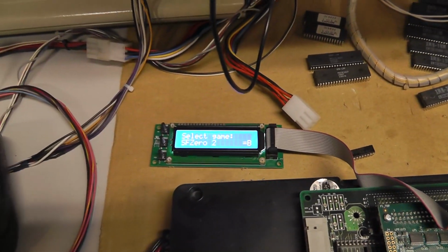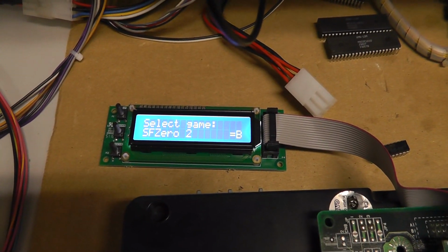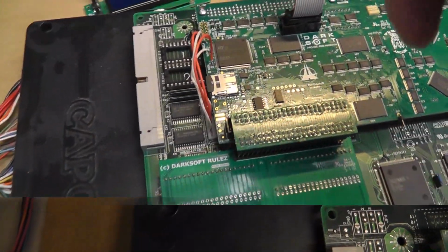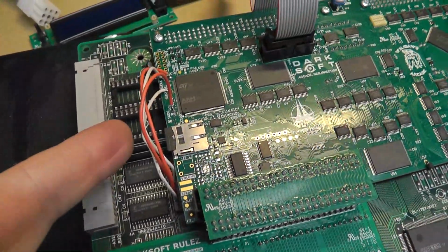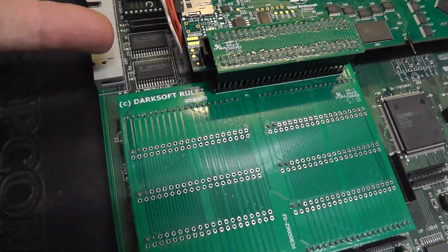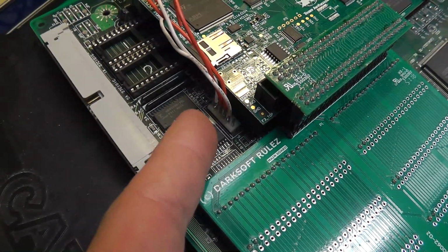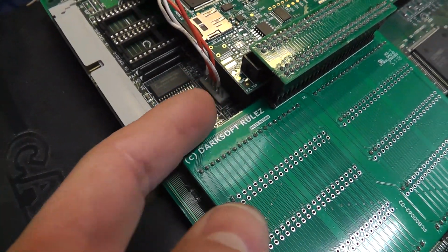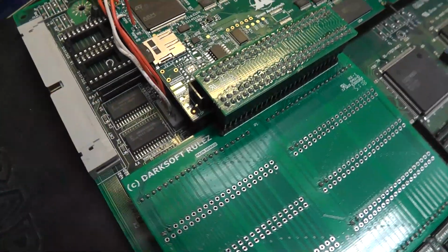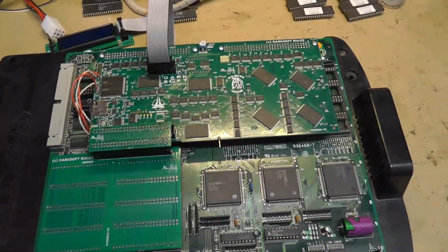Oh, you know what? I didn't check to see if there's an actual key in that folder. There should be, I think. I don't recommend doing it this way, but quick and dirty. I did the little jumpers, data, clock, and hopefully the pins are going to the left there. 1, 2, 3, 4, 5, and 6. I see a number 6 over here, so I'm hoping that is correct. Plug me back in.